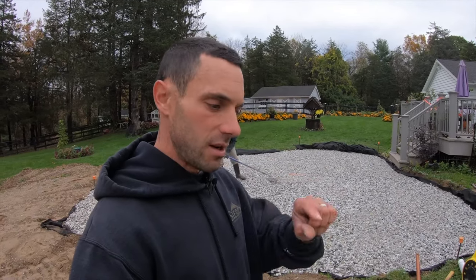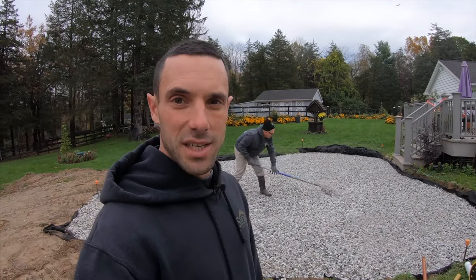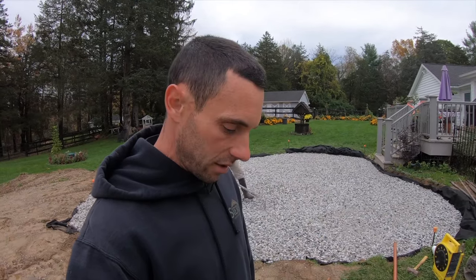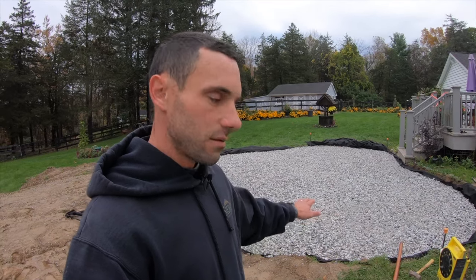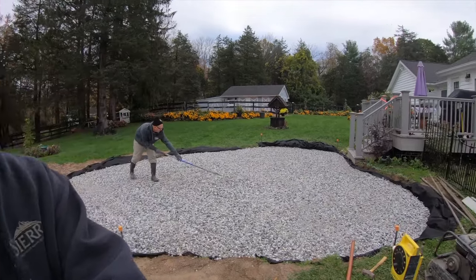Depending on the materials and the size of the equipment, a lift might be anywhere as small as 1 to 2 inches. It could be as great as 6 inches. Once you get above that, without a lot of complicated equipment, you can't verify compaction. So for the sake of what we're doing with this open grade of gravel and the size of the equipment that we're using, a 6-inch lift would be sufficient. They're going to finish this up, and then we'll screed out the final layer.